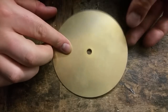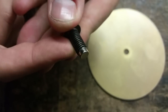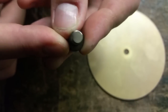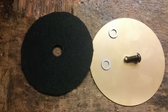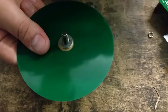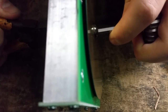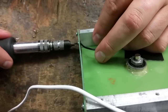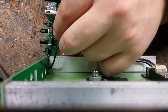Next, we assemble the jog wheel. The wheel itself is made of — surprise surprise — a PCB. Into that goes an M8 Allen head bolt with a diametrically polarised magnet glued to the end with epoxy resin. You'll have to file the end of the bolt down flat, and getting the magnet to sit in the exact centre is tricky. Perhaps assemble the rest of the jog wheel first so you can spin it in the bearing and check the magnet's alignment before the epoxy dries. You'll also need a couple of M8 washers, a mini slip mat cut from a full-size one, and an M8 nut. Put the bolt through the jog wheel, the washers, the slip mat, and finally the bearing. Attach the nut on the other side and tighten the whole assembly. We also need to ground the aluminium bars — loosen two of the rear plate screws, jam a wire in between the bar and the plate, then tighten them again. This wire should be soldered to a ground point; here I've used the metal shell of one of the volume controls.